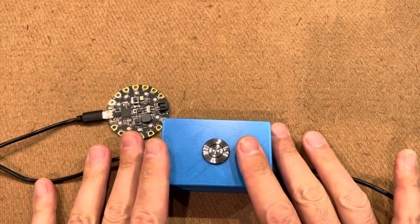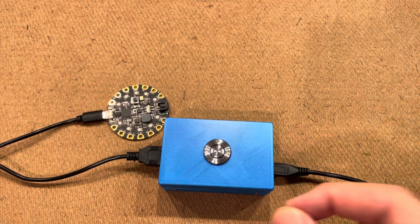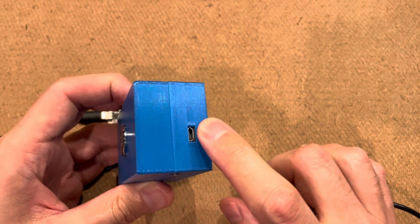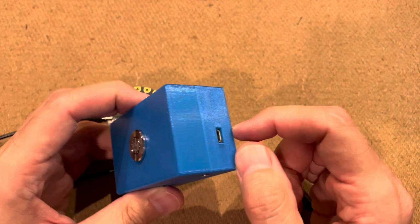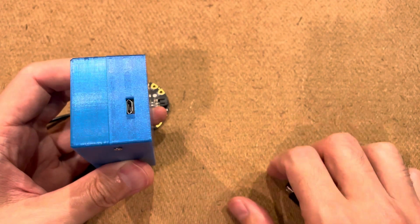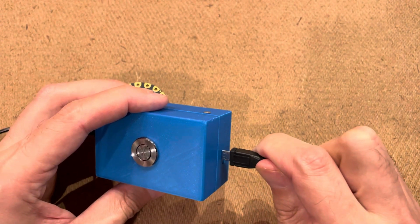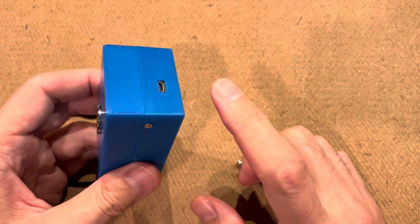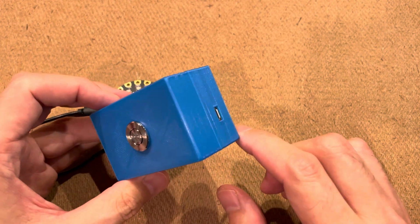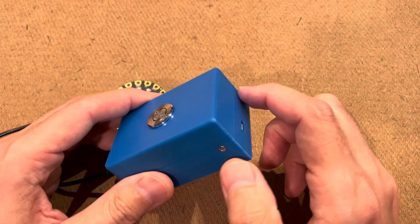Not a big deal. This is a homemade PCB, and that USB connector, the first one I put on, micro USB connector, I tried to make sure that it was really solidly on the board, and I soldered the little hold down tabs, and I got solder inside of the socket, which made it completely, the tolerances on this are so tight that if you do something like that, this will never plug in. So I had to actually take it off the board, in which process I lifted 3 pads, and then I had to put another one on the board, and then I had to put a little tiny piece of magnet wire to jumper it across.